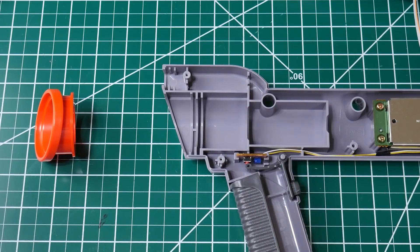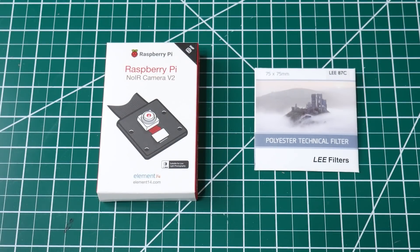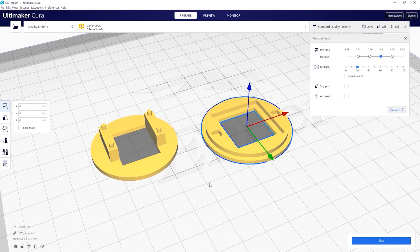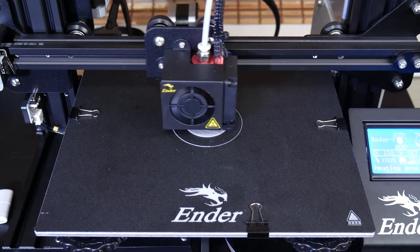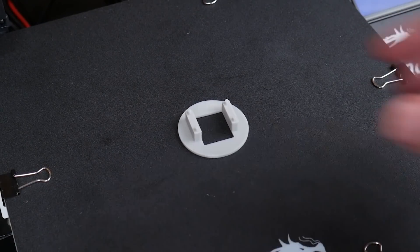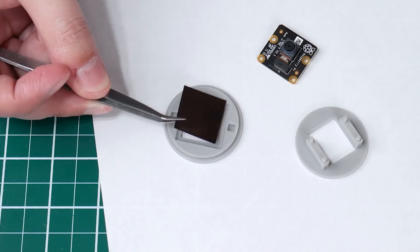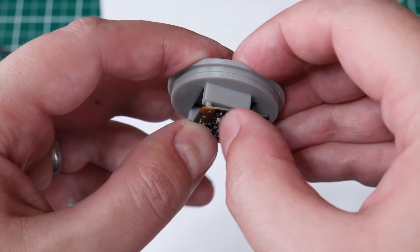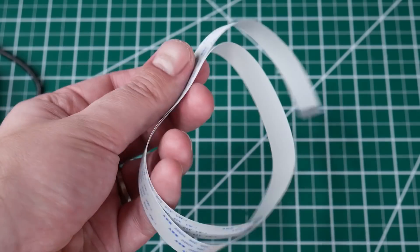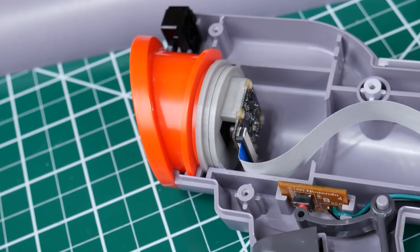The SuperScope has a magnifying lens that projects light from a CRT onto a sensor. We don't need that lens — it's actually the perfect place to mount our camera. We've got a one-inch plastic square to keep dirt out and prevent people from poking the lens, then an IR-passing filter, and finally the camera. We'll print a two-part mount that creates a sandwich with the clear plastic and filter inside, plus a couple of posts on the back to stick the camera on. Everything fits just like it should. The camera just pops right on. There's room in the back of the case for the Raspberry Pi, so we'll need a 50-centimeter cable for the camera. Finally, we've secured the camera in place with hot glue so it doesn't rotate and give a crooked image.